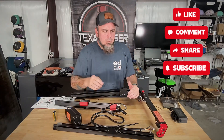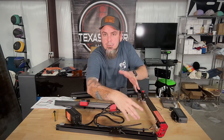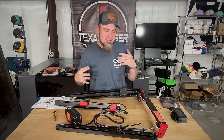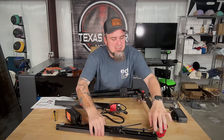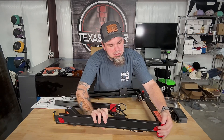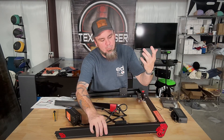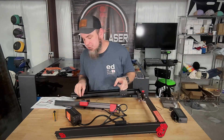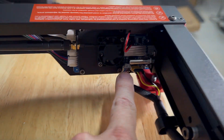On this next side rail you do have two little plugs right here, and I do recommend plugging them in before you get this all bolted down, just to make it a little bit easier on yourself — it's not fun trying to maneuver stuff in tight little areas. You gotta be real careful on this one because you don't want to damage that motherboard, because then you've got a paperweight. Just be real careful whenever you're sliding this in and tightening down.